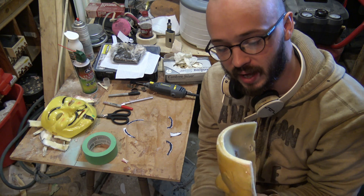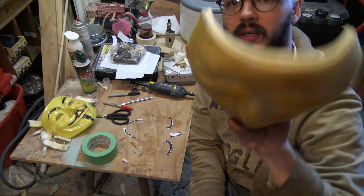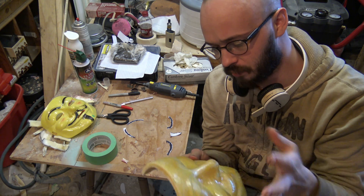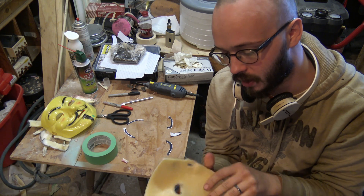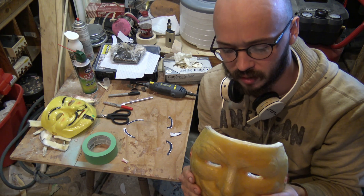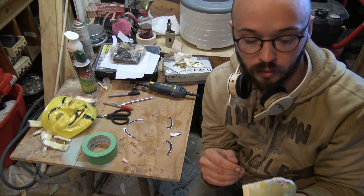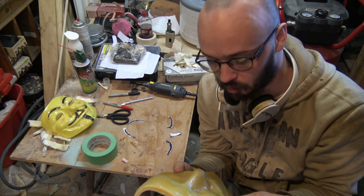It's been a few days — I added another five layers of Spectra cloth and this is how it's looking now. That's how thick it is. There are a few blemishes and some air bubbles trapped in there, which was expected given this very complicated shape, the thick resin, and no vacuum bagging. If I had used vacuum bagging I could have probably reduced air bubbles down to nothing. If you want to go that route, try it with a slightly thinner resin for better results.